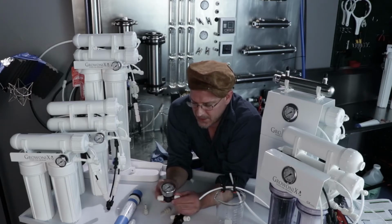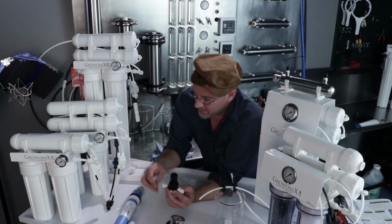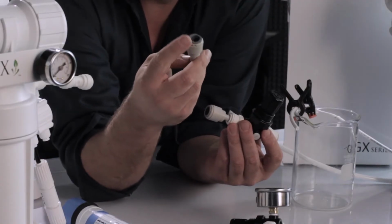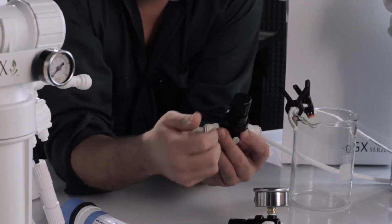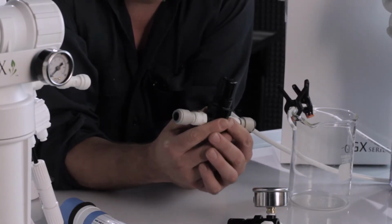Now, the adjustable pressure regulators have 3/8 fittings on them because all our small water filters are plumbed 3/8. But if you wanted to use this on a scrubber or a bigger RO system, we carry these stem enlargers. They'll go from 3/8 adapted up to 1/2 inch. And you simply plug them in. Now you're up to a 1/2 inch adaptation.